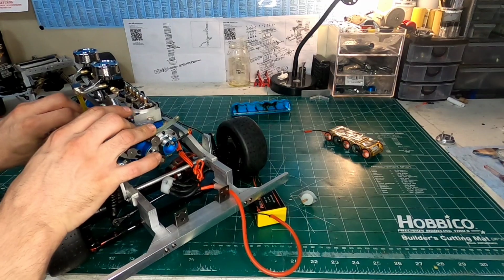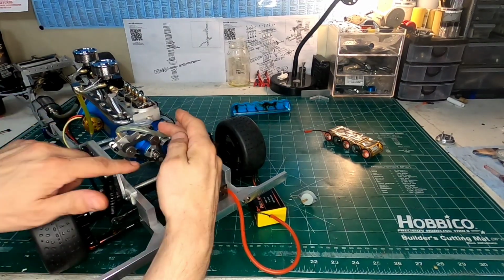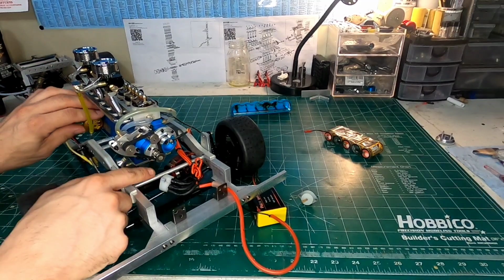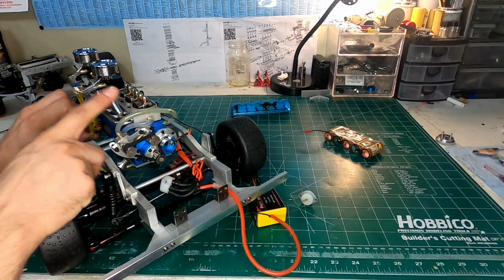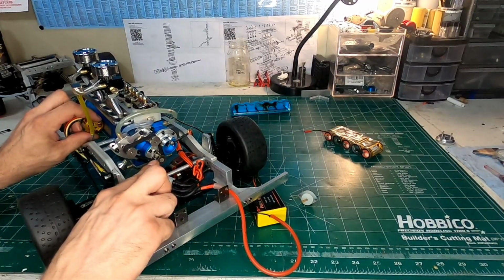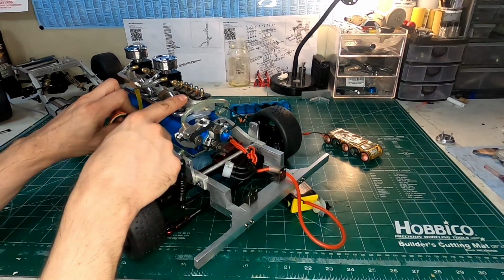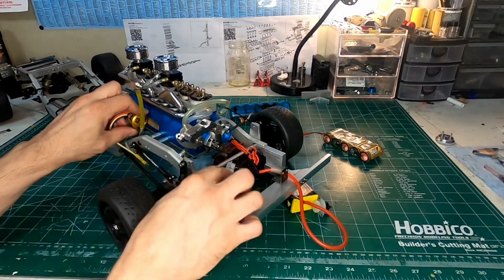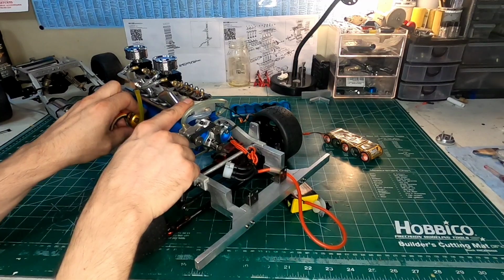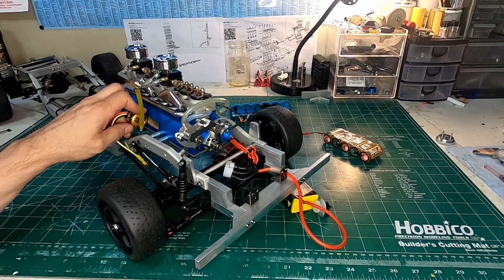Now, right now, I know without looking at anything, I'm on my exhaust stroke, and because I've marked where my top dead center is with a black Sharpie mark, I know that I'm about to push everything out, and if I'm correct, my intake valve is going to start opening right away. There's that black mark I was talking about. So now the intake valve is opening up. Okay, so now I'm at top dead center. This is flat, so this is top dead center. Both valves are overlapping right now, so any excess or unspent gases are exiting the cylinder right now.